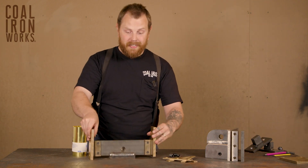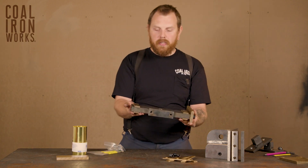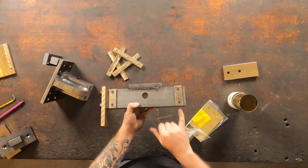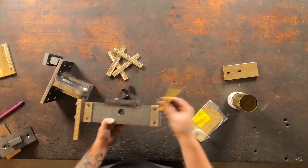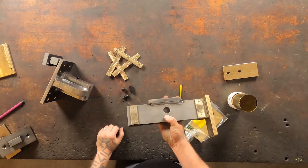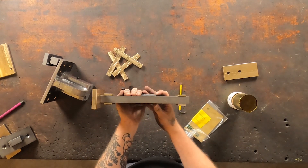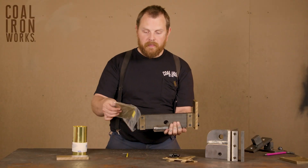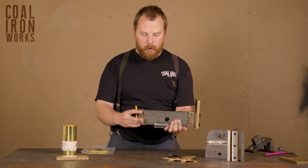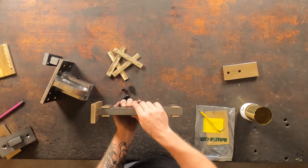This is a 12-ton slide assembly. These are the outer bronze — took this one off — and these are the inner bronze. You can see here that if I take one side of my bronze off, I can actually slide this out of my press frame and I have access then to the inner bronze. These are using a 5/32 Allen to tighten them, and on one side they're counter-bored and on the back side they're tapped. If I need to take slop up front to back in my press frame, I can use shim stock. This is 15 thousandths, available from McMaster-Carr, all the way down to a few thousandths. I'll loosen my inner bronze, opening them, and slide the shim stock behind to make them physically thicker and take up that wear in my slide assembly from front to back.